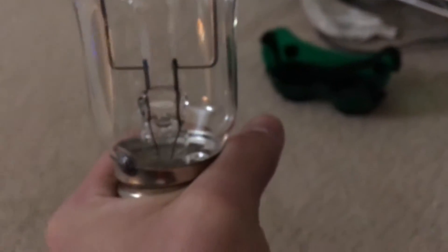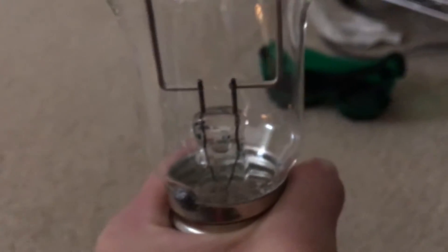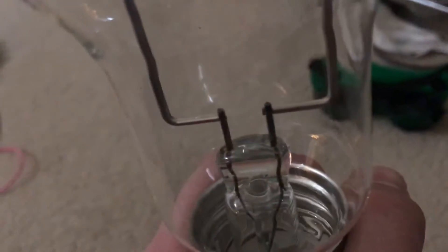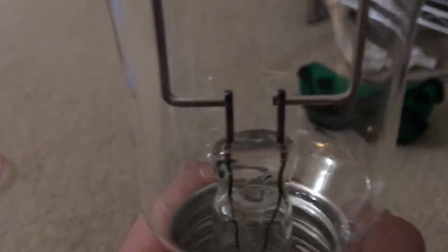Now that we're done with the etch, I might as well show you the construction real quick of this lamp. By the way, this is actually a brand new metal halide lamp as a fun fact. You can see the stem right there and the base torqued onto the glass of the lamp. You can see all the wires from the base going into the stem and therefore getting welded and processed to get to the arc tube to produce light. Here's the wires — there's the probe start resistor. You can see the probe circuit very clearly as well.